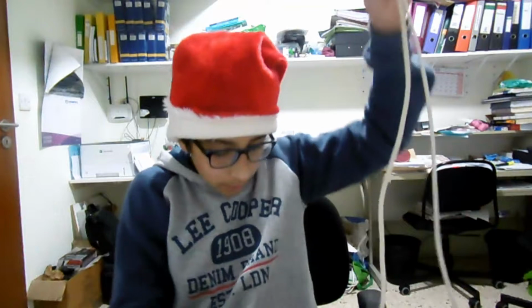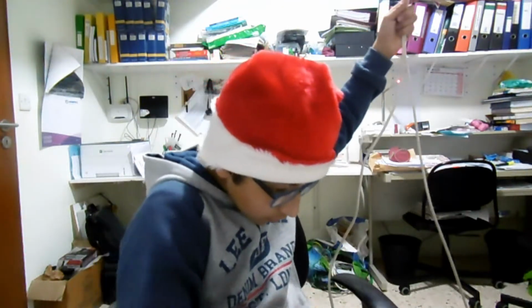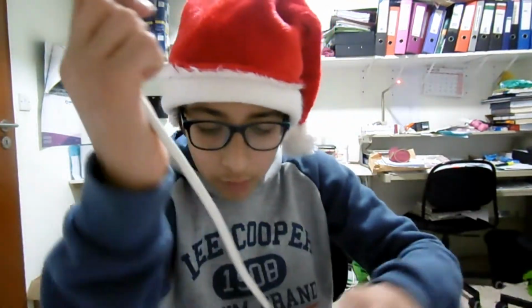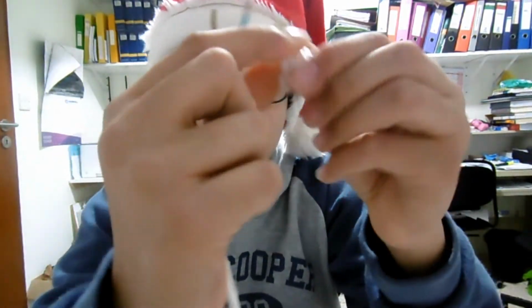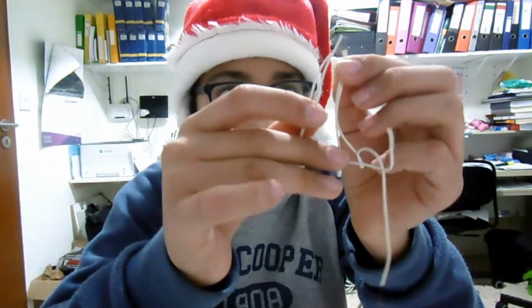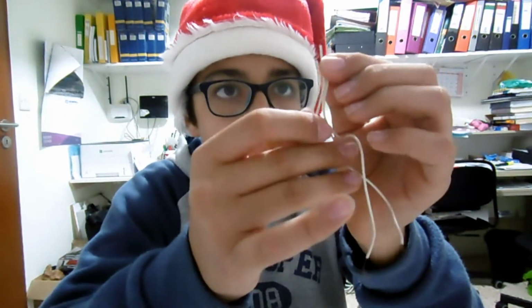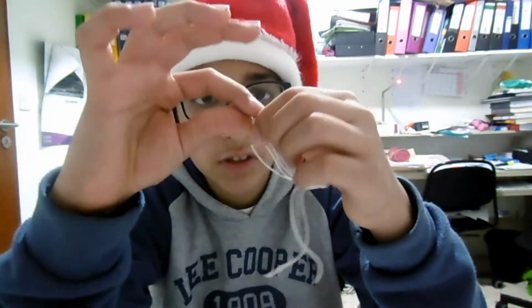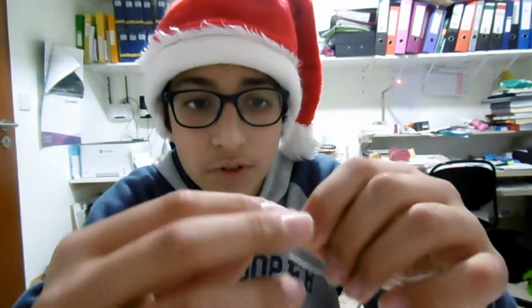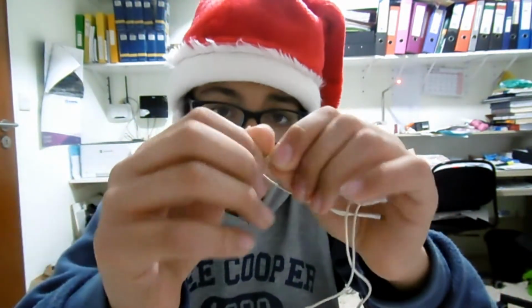Good. And then with the other wire, which is this, we have 2 pin. And we get our 3 bulbs. And we repeat the process. Get the 3 wires, tie them together to connect the 3 bulbs in parallel. If you connect them in series, they'll be very dim because you have a voltage drop across them, and it won't end well. And we need bright bulbs, not low current draw.